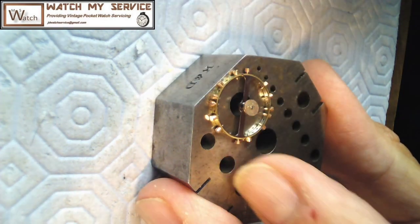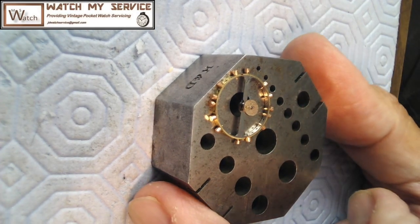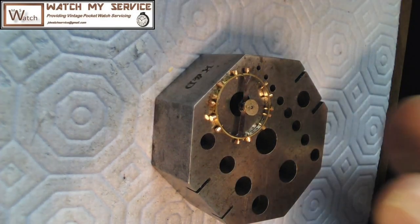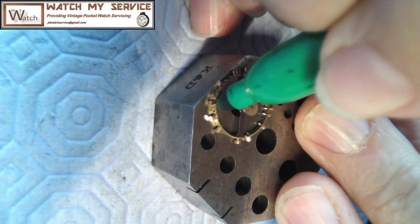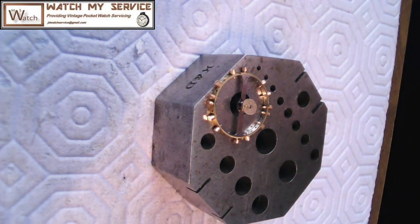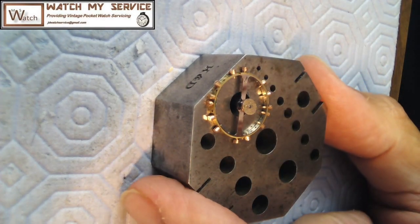So that's kind of where I want to stake that on - it's not too difficult to stake that on. When you select your stake you just have to make sure you bear in mind where that impulse jewel is so your stake doesn't smash the jewel. If that happened you'd have to shellac the jewel back on, which is no fun. It's very doable - I've made videos on that - but it's really not needed if you do it properly.